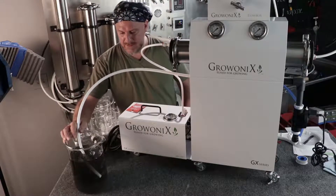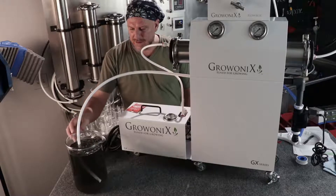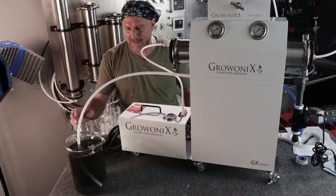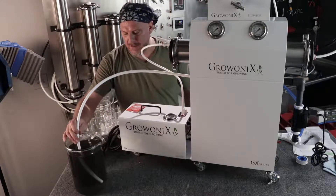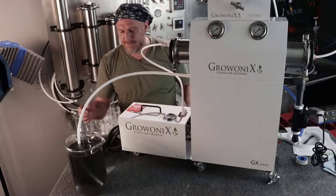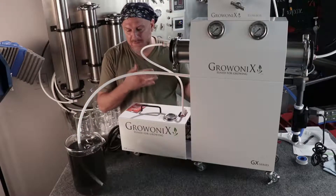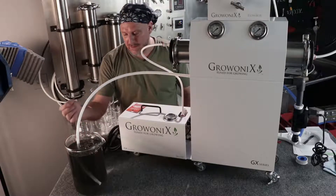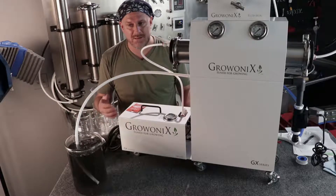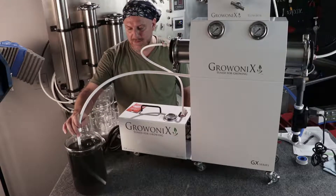I'm going to turn it off to show you. So now you can see this is the carbon dust. Our carbon filters are really highly catalytic KDF carbon, which is a bed of KDF 85 underneath a big thick bed of highly active catalytic carbon. It's the best carbon on the planet, but it's dusty. You need to flush all the dust out. This beaker is only a one gallon beaker — you need to flush this carbon filter for about 20 to 30 gallons, until this water is clear. You can see it's obviously cloudy and impregnated with carbon fines.